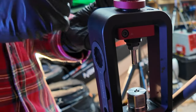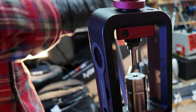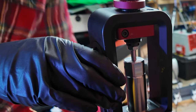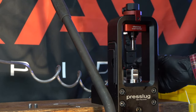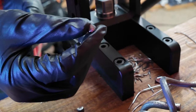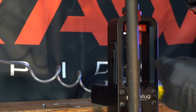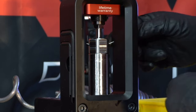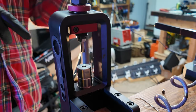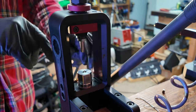Let's go ahead and try a different size blank. Now we're going to use the smallest blank I have made. Go ahead and insert that into the die — it falls right in there. Pull the arm down. Make sure it was crushed all the way. There it is. Didn't see any waste, but that certainly doesn't look like a slug I'm going to be able to use — wasted lead again. Let's try the next largest size. Put that in there. This is a little smaller than the first one. Yep, there's a little waste there — not too bad, much better. Definitely not wasting as much lead as in that first trial, but that blank is probably still just a little too large, and I'm not a fan of wasting lead.